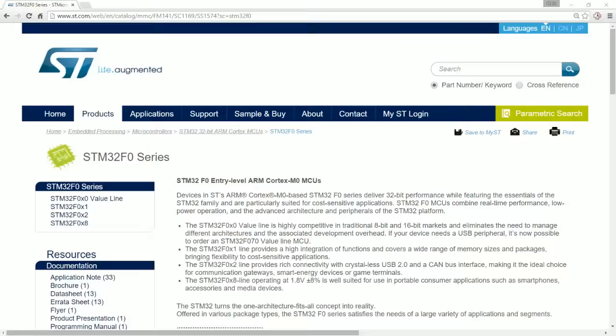So we're talking about the F030 — let me pull up the page. Here's the series. The Nucleo board we've got is meant to be a low-cost, low-end processor. It's got those Arduino breakout pins, it's about a ten-dollar development board. It's got the F030 R8 on it, built-in debugger, and it's got pretty much everything you could do in Arduino but with the flexibility to write your own code directly to it without any limitations.